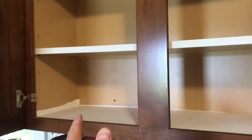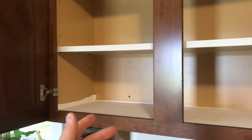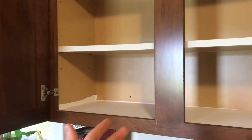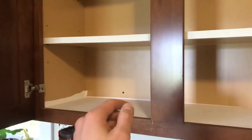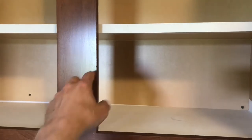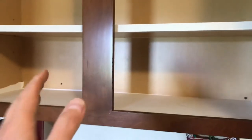In Europe they make a lot of cabinets without face frames. Some people are getting those in America — they have a kind of modern contemporary look and they're mounted a bit differently, and I'll talk about that. But for most American cabinets, you have a carcass or body and then you have the face frame to hide the plywood edge of the cabinet.